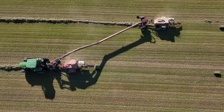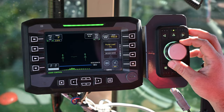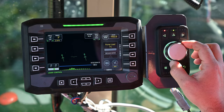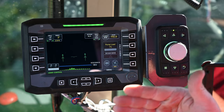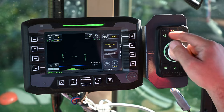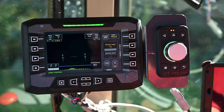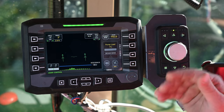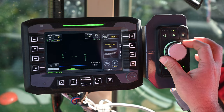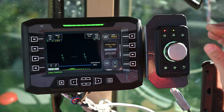If your baler isn't centered on the windrow, you can change that offset by turning the encoder knob to the right or left four clicks. What that does is the LiDAR thinks the windrow is in the center, but it will notice the windrow needs to be offset left or right. If you turn the dial one degree to the left, a red light comes up and it will allow the baler to follow what the LiDAR thinks is the left edge, but actually be centered on the windrow. For example, if a tire went on the windrow and flattened part of it, the LiDAR would think the center is further right than it actually is — you can fine tune it here. The red light shows how many degrees of offset the LiDAR is applying.